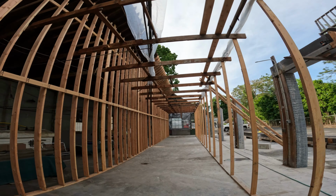because I was mentioning a few days ago that we really want that metal beam to be parallel to the ridge on this building, because, you know, in a perfect world, all your rafters are going to be exactly the same.